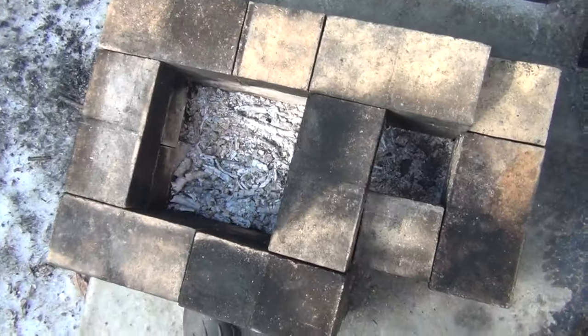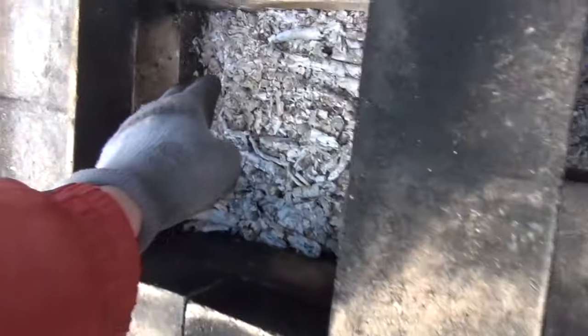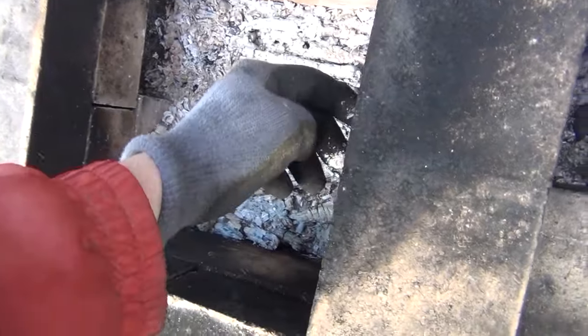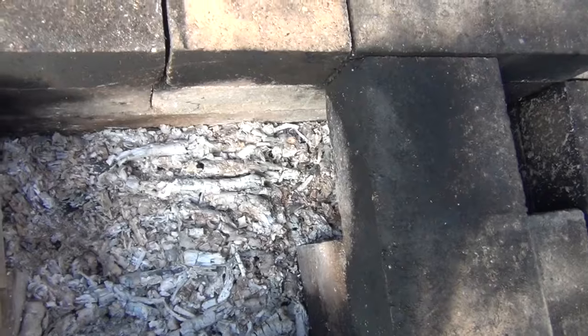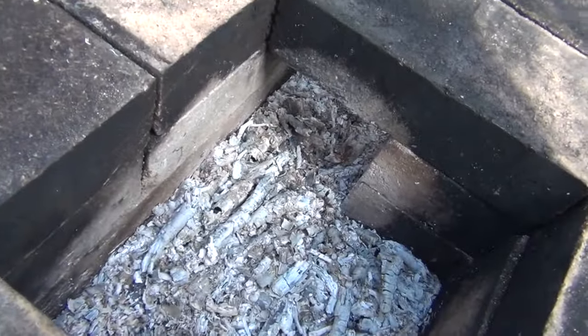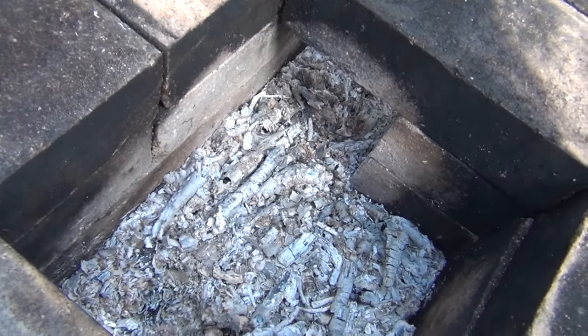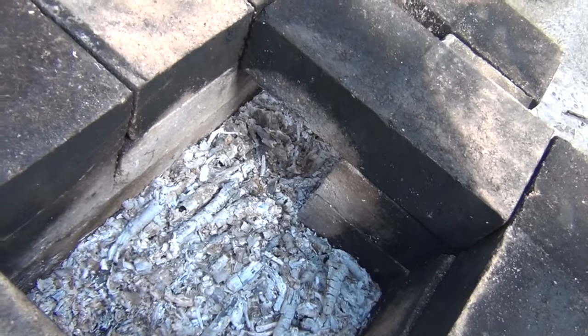Of course, if you're going to make this for yourself, you want to use mortar. We'll have a mortar discussion some other time. So the air hole is just one half by 1 brick. And this is a little bit higher too. I don't know. It might be better to make something a little bit higher to get into the riser. Maybe that would keep the smoke from coming up. Make it a little bit bigger, then it becomes more the size of a batch box port.